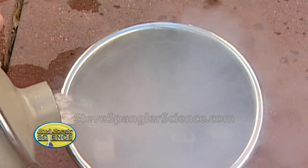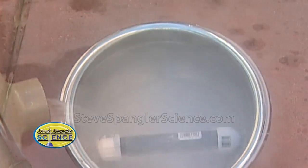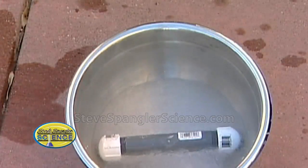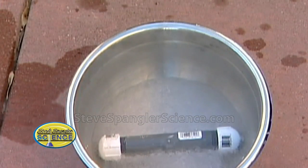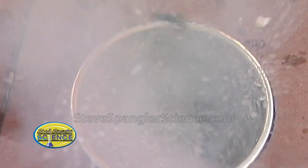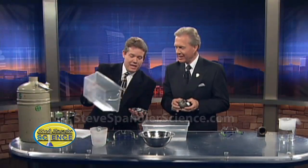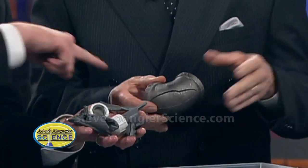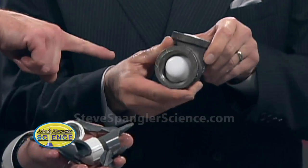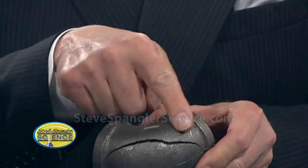And PVC — if you think about your sprinkler system as well, if you just leave a little bit of water in there, and again it's completely filled with water, this has a little bit more explosive force. Watch this: three, two, one. Look at it in slow motion — when it actually goes, you can really just see it kind of take off. And now of course you have water pouring into your house. That's all that's left of the PVC — this is what I have left of the plastic pipe. So now you realize why you get so much damage. Take a look at the frozen ice on the side, there's ice still inside, and there's the crack. You see the crack in the pipe?